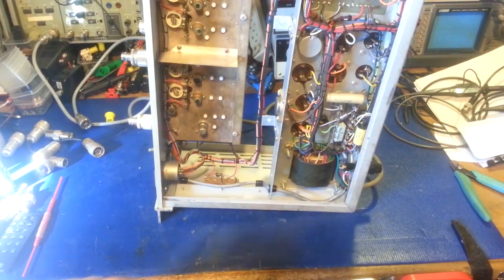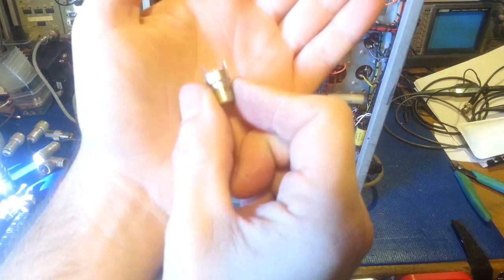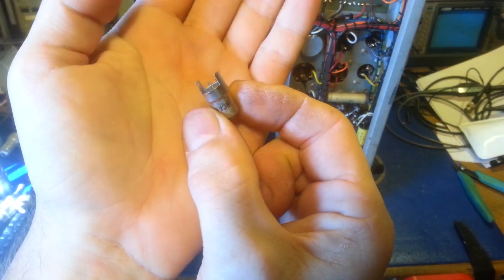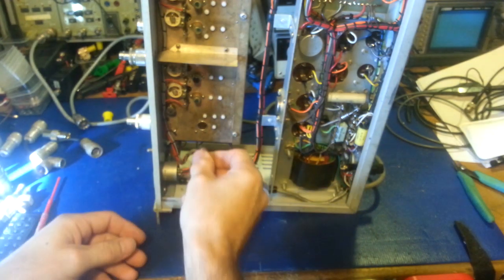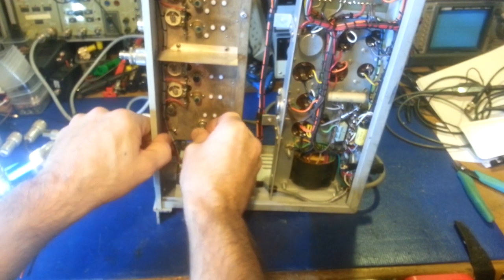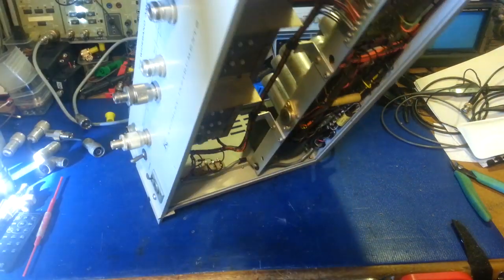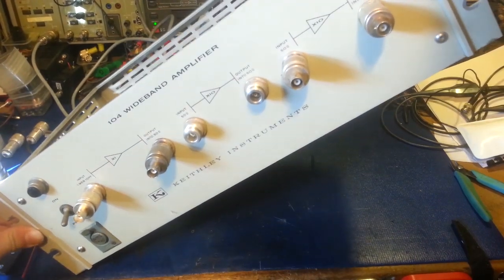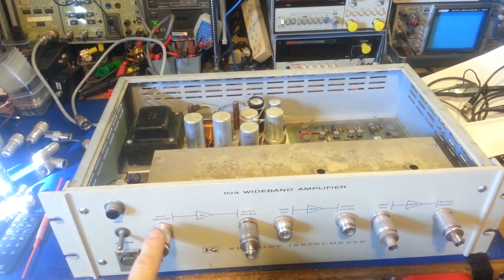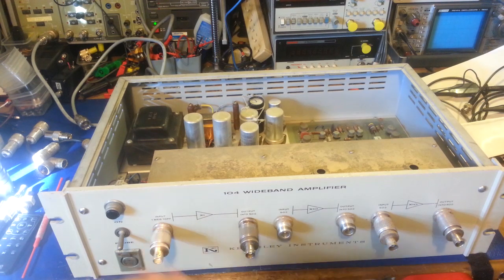What gives it its high input impedance is that right there - a Nuvistor. So there's the first stage, and it's not actually an amplifier. The first stage in this is basically a 1x - it's a one-to-one ratio so it's not really meant to do any amplification. It's designed strictly to be used as a one megaohm input. You can see 1x, then we have 10x and 10x. So this input right here is designed just for that, so you have a high input impedance if you don't want to load down a circuit that you're actually testing.